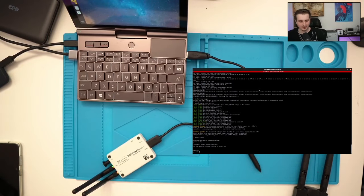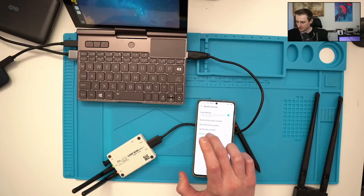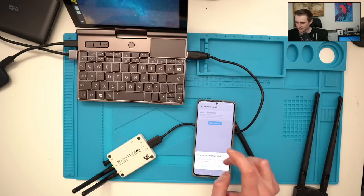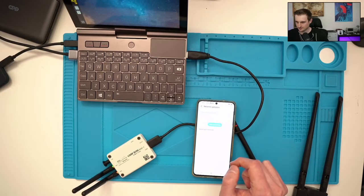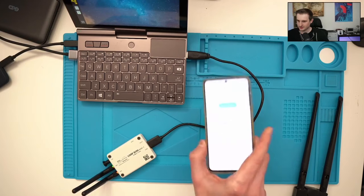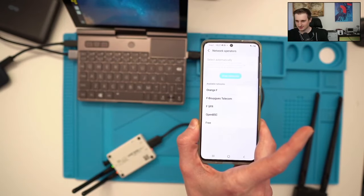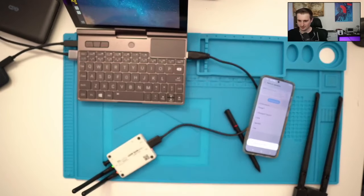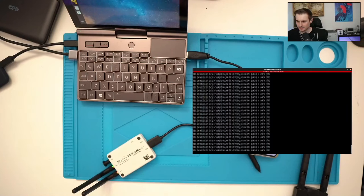Once it's ready we have a nice command line interface, and we can test with a mobile phone to see if it can detect the base station. I set the phone to 3G only and do a network scan. As you can see, it finds 'OpenBSC' — which is our OpenBTS UMTS station. We've successfully popped up the UMTS node with the USRP B205 mini, and you can run srsRAN for LTE tests as well.